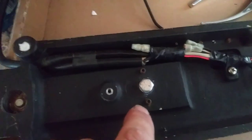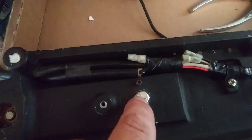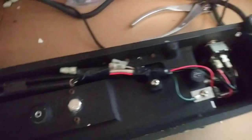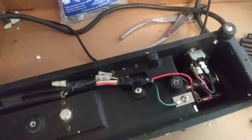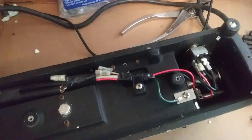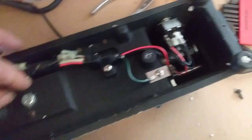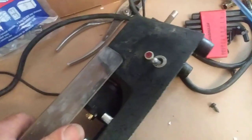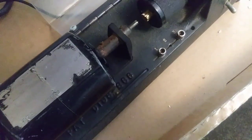If you look down here at the bottom, you'll see two Allen screws and this bolt right here. So if it's out of calibration — when I say out of calibration, when you go to cut a key, if it's cutting one side of the key but then it doesn't touch the other side, or if it's cutting too deep into the side of the key — what you're going to do is loosen up this bolt here and loosen up both these Allen screws. Then you're going to slide this open, if you can see in there, to one of those existing cuts.